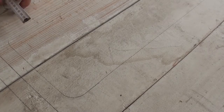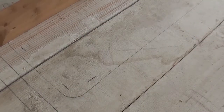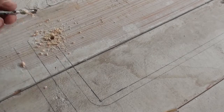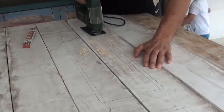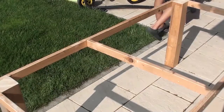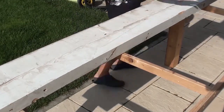Now you create the cutting line by moving the line one centimeter inwards from each side. So that the jigsaw can start somewhere, I drilled a hole the thickness of the saw blade in every corner, then sawed along the line. After you have deburred all cut surfaces and provided several support beams, you can finally connect these bottom beams to the basic framework.